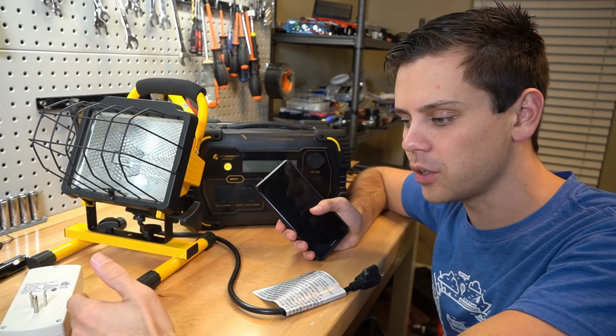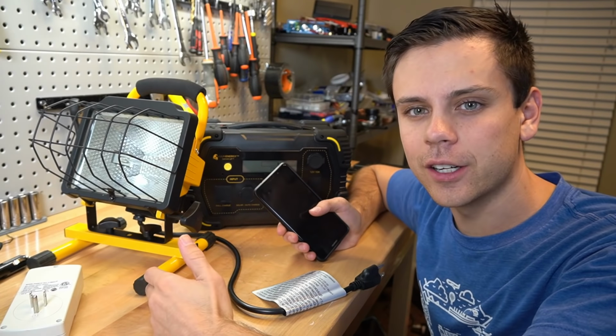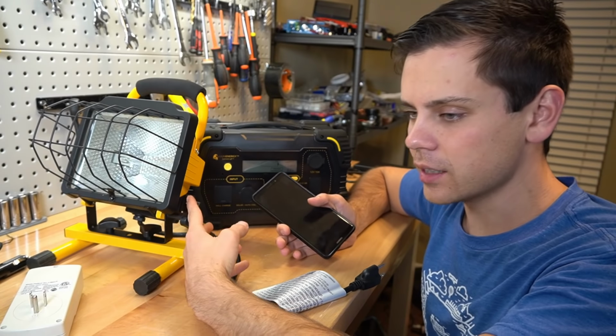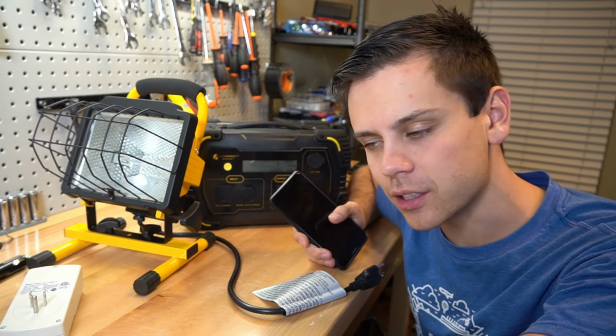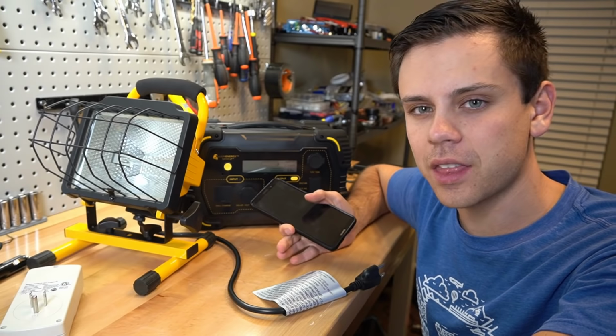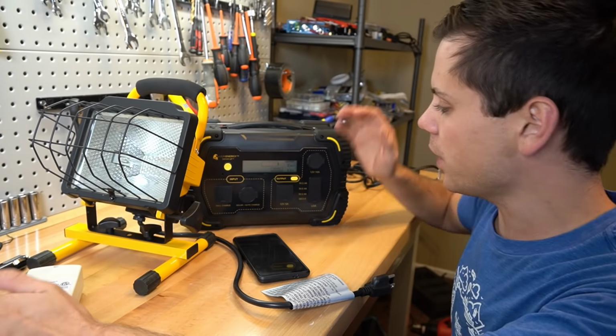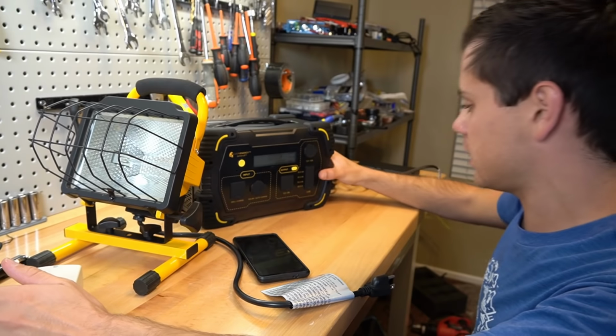You know, it's so important to derate your units. If it's a 1,000 watt inverter, call it an 800 watt inverter, because when people review it, they do a test like this, and it's like, oh my gosh, that's so impressive. And if every manufacturer did that, their products would look amazing, especially with electrical stuff. Anyways, yeah, let's wait till the morning and we'll get the next test going.